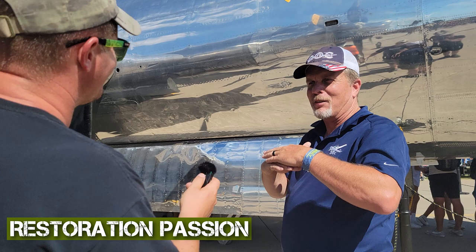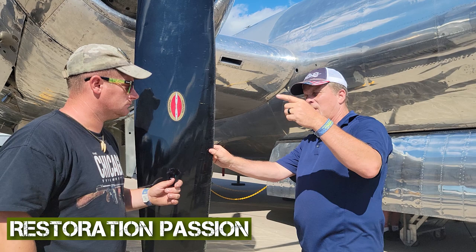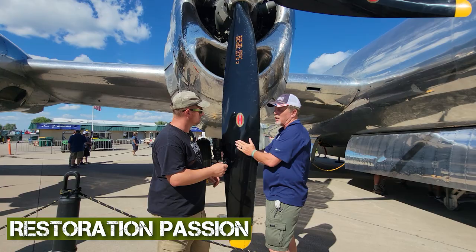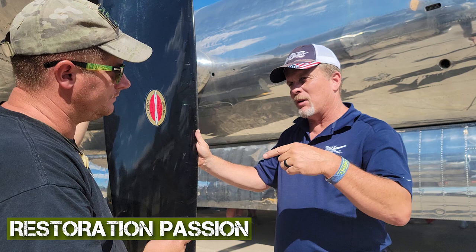So we'll cycle these things through. It gives you 2 full rotations through the reduction gear, so make sure that every cylinder clears. And I'll do that every time before I start the engines on this. And you'll notice that most warbird operators pull these through by hand. The B-29 is a little bit different. We don't have the original inertia starters on this thing anymore, but what we do have is a starter that has a clutch on it. Okay. And it's not just because we're lazy, but you and I pulling on this massive propeller have actually enough strength and enough leverage with this monstrous thing to cause damage to the engine if we encounter a lock ourselves. So I use the starter. I know it makes me look lazy, but there's a purpose behind it, because as it starts feeling the resistance, it'll actually disengage from the crankshaft and stop the rotation of the engine.